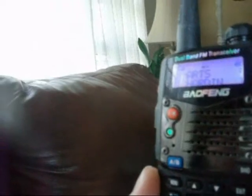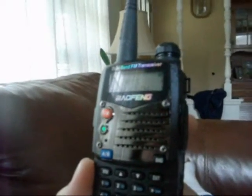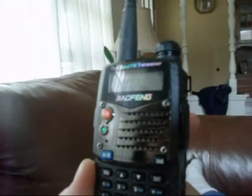Alrighty, well that's good to know. It's got good receive too, real clear audio on this end. I wasn't sure if I was keying the repeater or not because I wasn't hearing a squelch tail. The repeater has a really short tail right now. One of the best ways is to key up your radio and hit star, I think, to get the Echo Link advertisement.